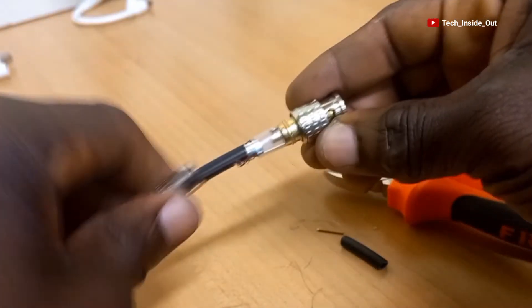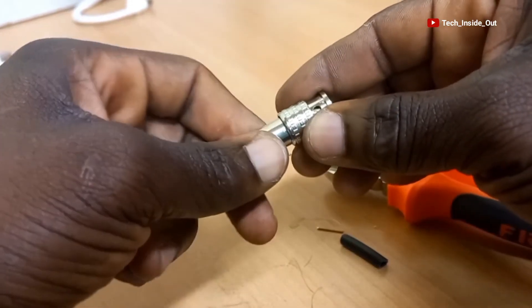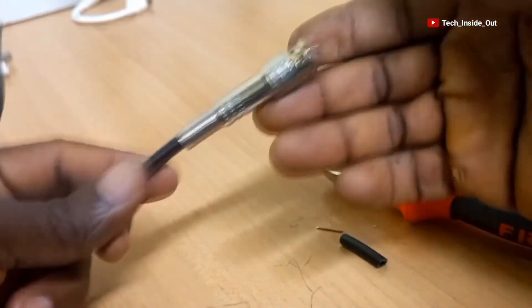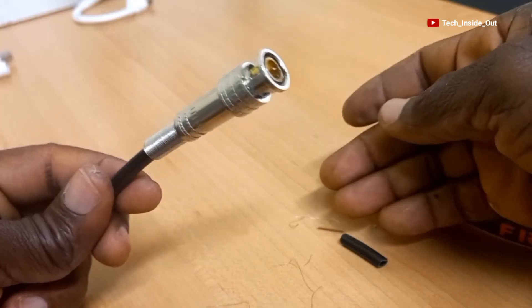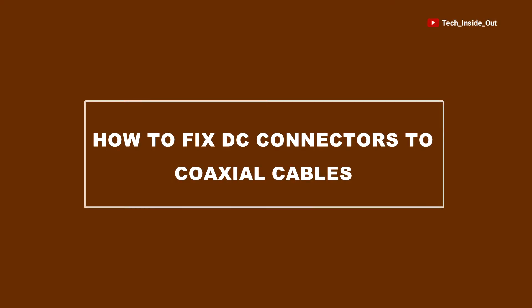This is to prevent contact between the braid and the central conductor. Then we can now roll over the main cover and close it up. Your BNC termination is ready to connect your AHD camera. Let's now look at the power termination.